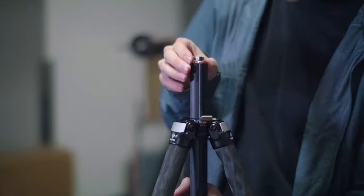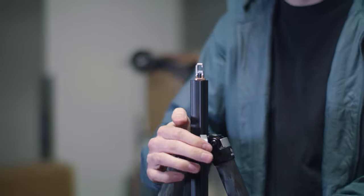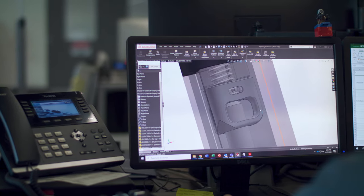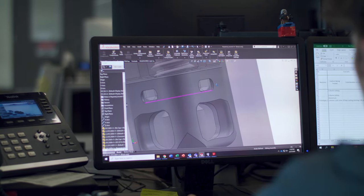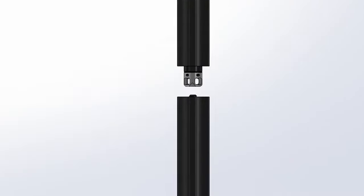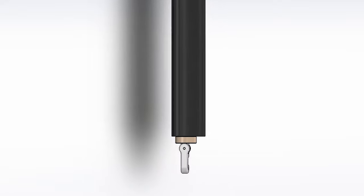Another challenge with a triangular profile center column versus a circular one is that the two halves had to be perfectly aligned. With a circle that wouldn't matter, but even a fraction of a degree off is going to affect the lockup and feel. To solve this, we designed an internal expanding collet that would align the two halves of the center column, using the connecting rod to cause the expansion — essentially something that can expand or contract to lock onto or align a profile. Despite being two separate pieces, when attached together it honestly feels like one rigid, solid bar.